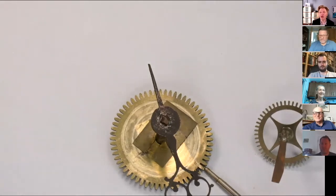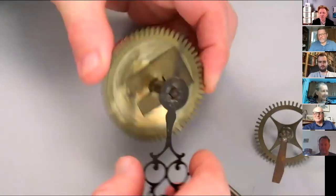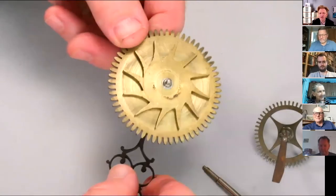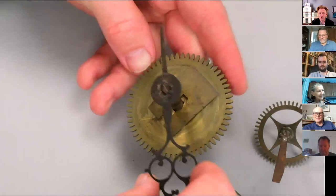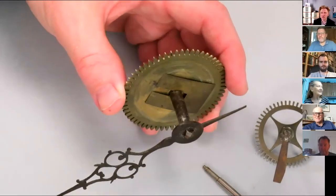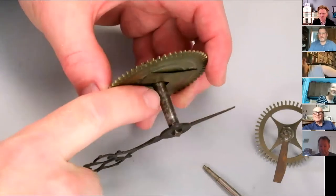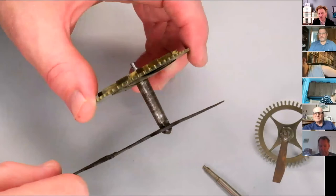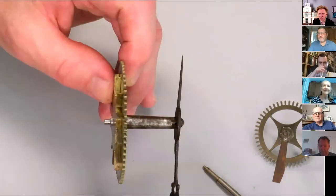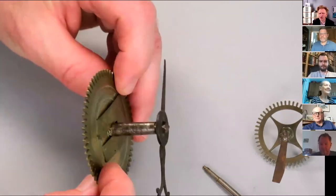Now, as you develop in your practice, and we hope you do develop, you'll start to work maybe on clocks like this that are pre-industrial revolution, effectively. So these, although they're made in manufactories, no, they're not individually handmade, they've actually got tapered components. And if you can see there, that shaft that goes between the hand and this wheel is not parallel at all.